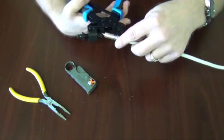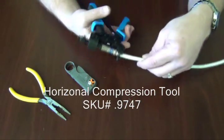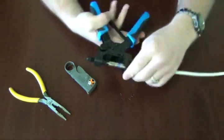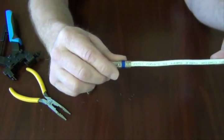Take a compression tool — a horizontal compression tool — and make sure it's on the correct setting for RCA. Compress down. Now you've got a completed tight RCA connection on RG6 cable.